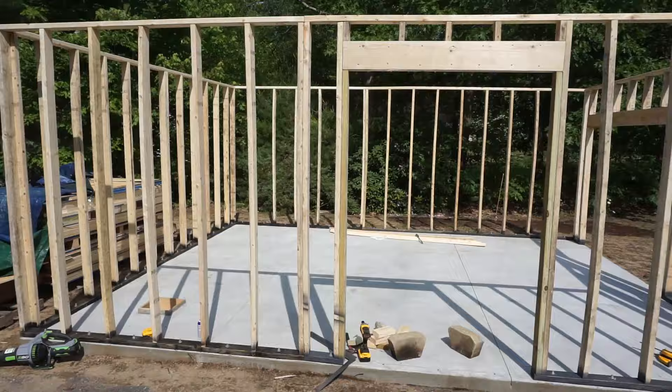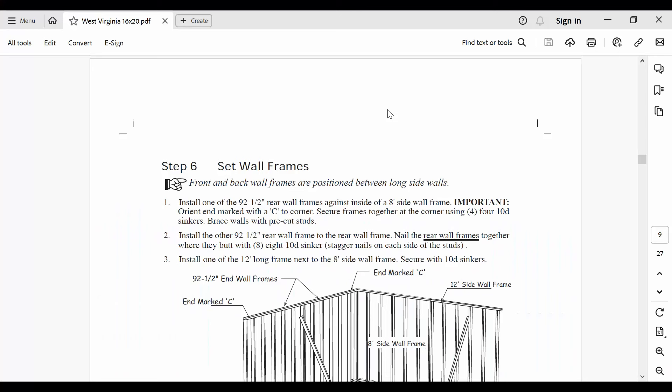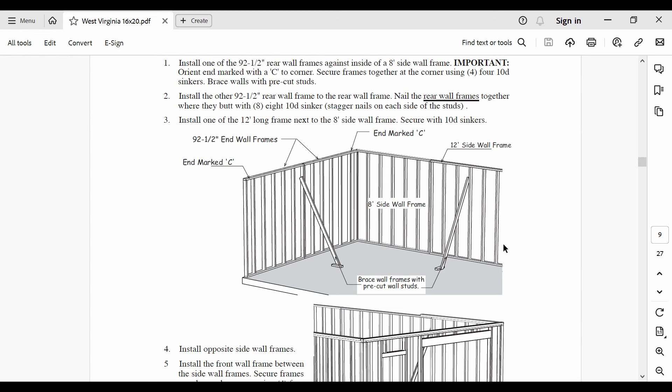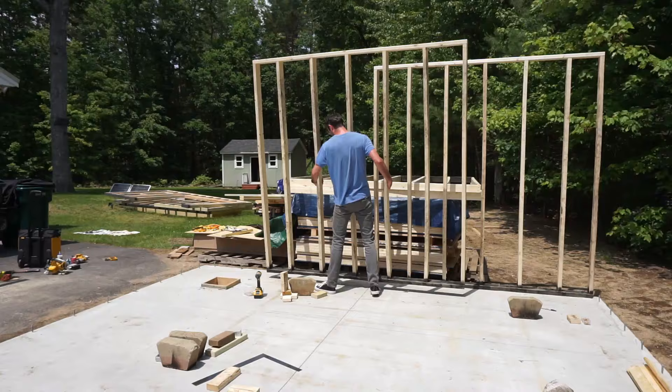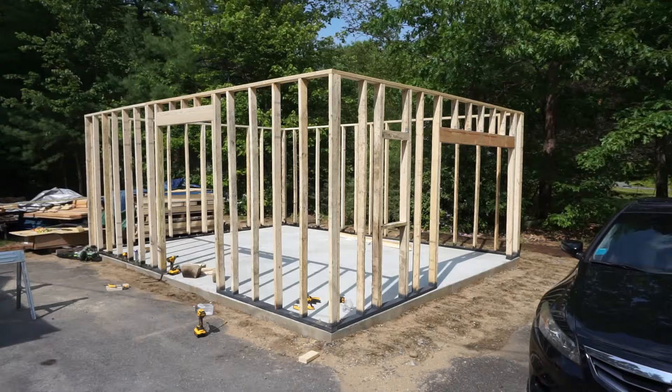One of the side walls was similarly built because it had to accommodate the French door on the side. I had to source my own lumber for the doorway header because the garage kit does not anticipate such a wide door on this side, and you need the thick lumber and extra studs to support the load from the joists and roof arches. At step 6, we can see the building start to take shape as we attach the stud walls to the foundation. Note that the instructions show angled supports to keep the walls straight and plumb. My first big regret is not doing this, as one of my stud walls is leaning a couple of degrees because I did not properly support it during this step.